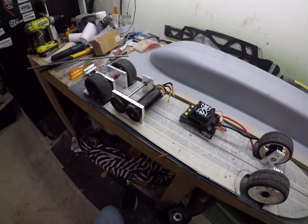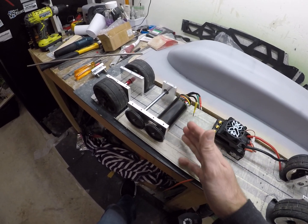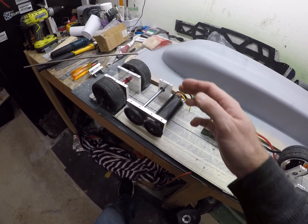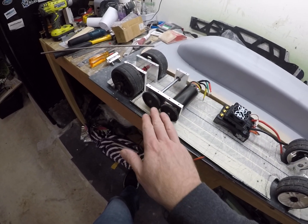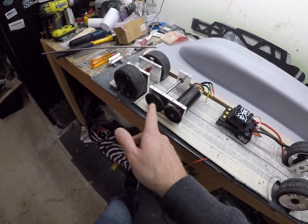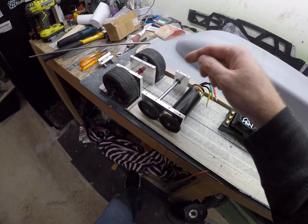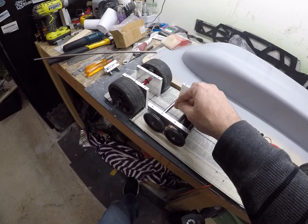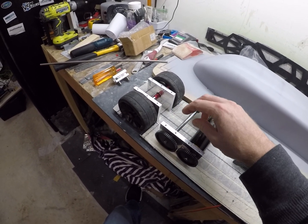So I've got to go back to the drawing board. I'm going to get something in between 1,400 and 1,700 KV, and then I'm going to need to — because I don't have a lot of room here unless I went with belt drive on this end, which I don't want to. So that means I've got to get a bigger spur here.